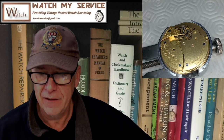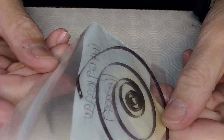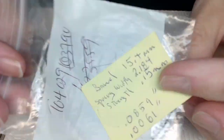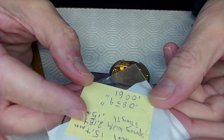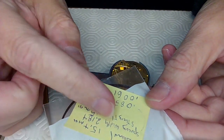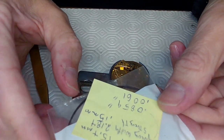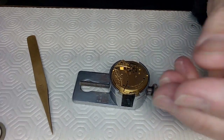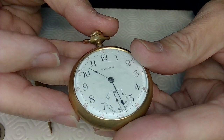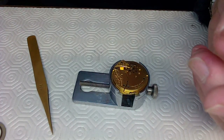Here's a picture of a mainspring from another watch — the spring width and strength was 0.15, barrel width 2.18mm, which would have been too much for this other watch, and the barrel was 15mm — also too much. This was for a size 12 Waltham. There's the Wally Waltham I wound last night, still running and keeping good time.